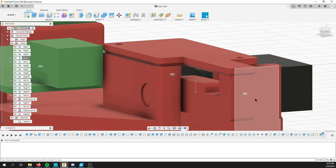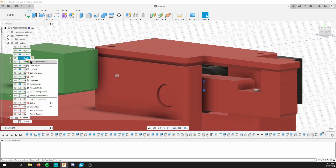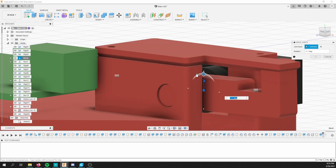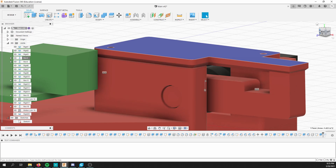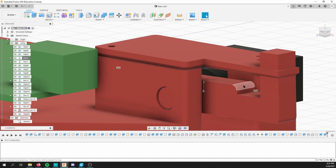This was the original design for the release mechanism. You can see it has a little hook connected to the servo and a little lid. The rope goes through this spot, and then when the servo opens like this, the rope is designed to fall out. Now that sounds great in theory, but because this piece of plastic was so thin, it just bent out of the way, so the whole piece of plastic lifted up and the rope just slid out. So what I'm going to do is make this much thicker, and also design it so that the rope comes up through a slot — so there's no plastic to bend out of the way, meaning the rope always has to stay in until the servo opens.